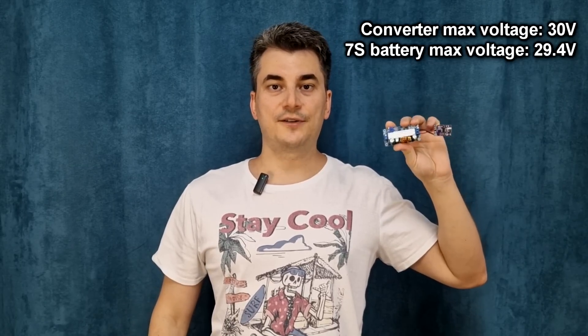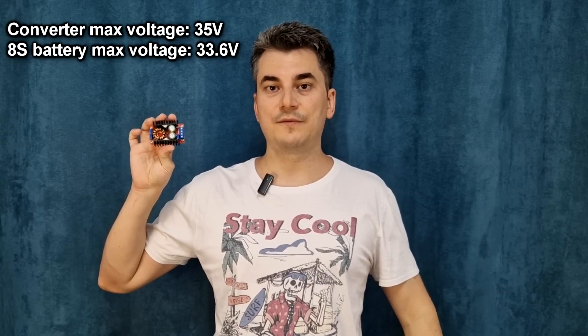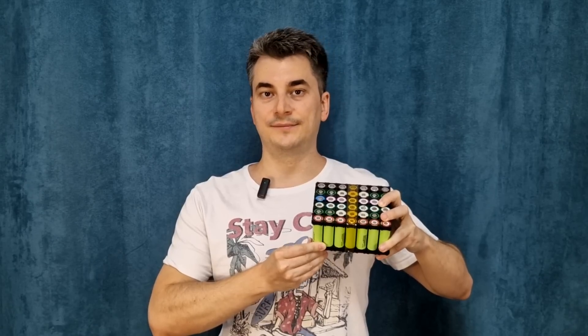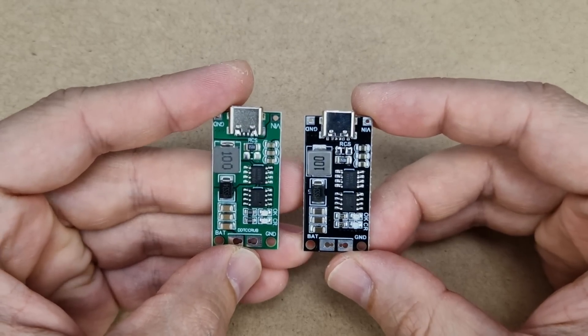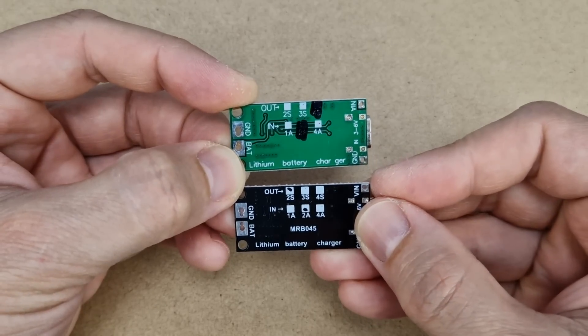Now I just need to find a way to fit these two components inside the power bank. You can use this PD trigger module and converter with a maximum of 30 volts for a 7S battery pack, or a converter with maximum 35 volts for an 8S battery pack. You can also add more cells in parallel to increase the capacity. Of course, the higher the voltage, the lower the charging current will be. With an estimated efficiency of 88%, you can charge a 7S battery pack with around 0.9 amps. In that case all components will need active cooling, and you need to test everything. But if these trigger modules and converters are too complicated, I have another simple and cheap solution.